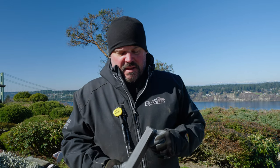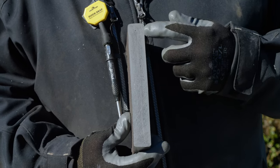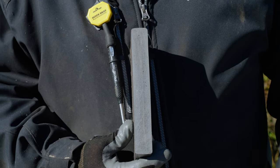If you follow me or know me through social media at all, you know that I'm kind of against doing miters on PVC decking because they're hard to keep together — you have to do a lot of work to prep those and over the years they just don't seem to stay. So I like to do a lot of what I call butt joints, where you actually overlap one board into another, face screw those, and cortex them so they stay together for a really long time. The problem with that is you end up with a raw end of a deck board or a piece of fascia, and in the past we've actually painted it — just ran a file around it and painted it.